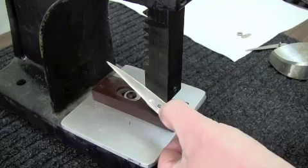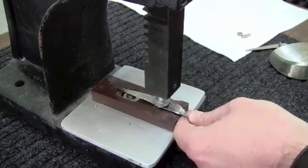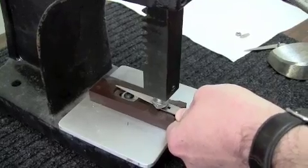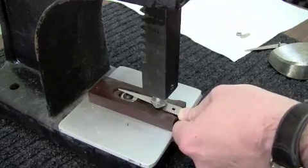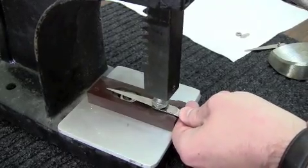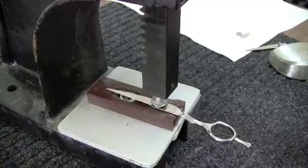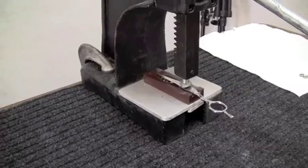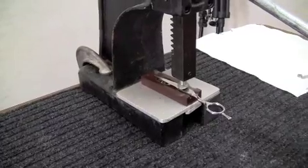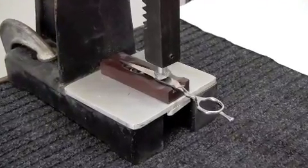The scary part is I'm having to start literally right over the hole in the shear, so hopefully it does not snap. Normally this should be bolted down on a countertop — you can see it wants to bend just a little bit and move. We're starting where that back area is, but we have not moved it yet. In order to get this to work right I need a little bit more pressure, so I'm going to have to secure this to the table. I clamped the press onto the table with a C-clamp, which will give me the stability I need.